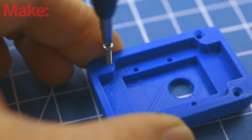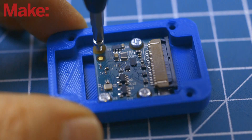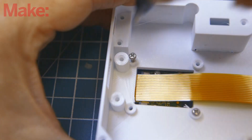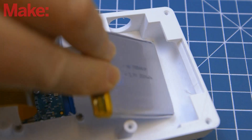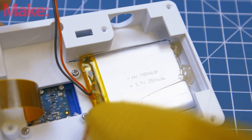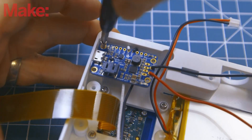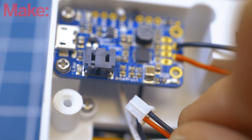Before assembling your camera, gently tap all of the screw holes using the M2.5 screws — it'll make the assembly that much easier. Attach the Raspberry Pi camera module to the front of the camera using the M2 screws, then attach the front to the camera body. Make sure the ribbon cable is oriented correctly and use caution — it's fragile. Attach the LiPo battery to the camera body using hot glue, then attach the PowerBoost 500C power supply to the case using the M2.5 screws. Do not plug the battery into the power board just yet — save that for the end.